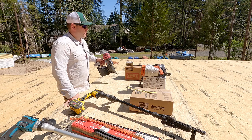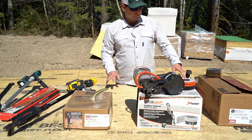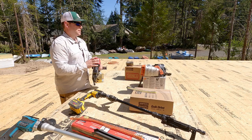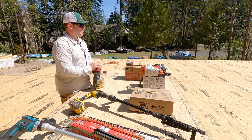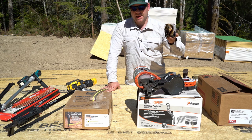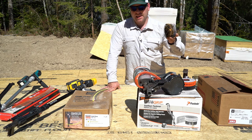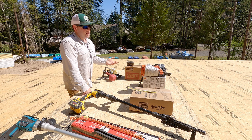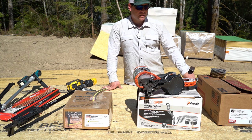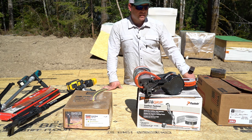Let me go through very quickly the cost. Whatever coil gun you use — standard pressure or high pressure — there's the cost of that gun, which runs about $600. This box of 6,000 nails cost $70, which works out to about a penny per fastener. It's a ring shank nail; the coating heats up and helps bond the nail to the wood — that friction as the nail goes in activates the glue. The idea is it's not going to work its way out and cause a squeak. This is by far the fastest system for us. Nailing off with coils is fast — about 250 nails per coil so we don't have to reload very often.